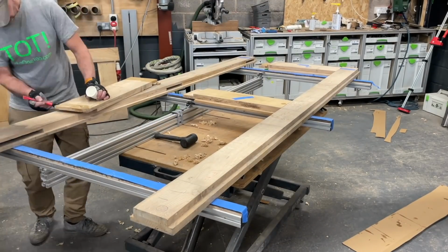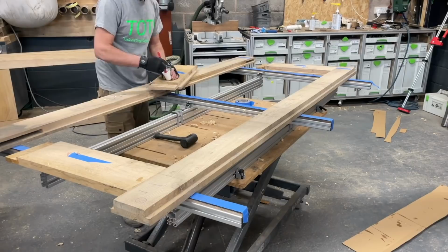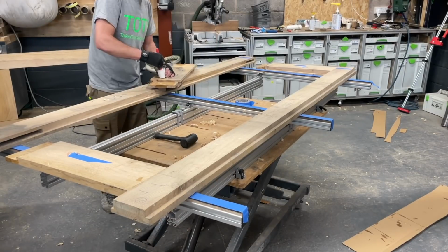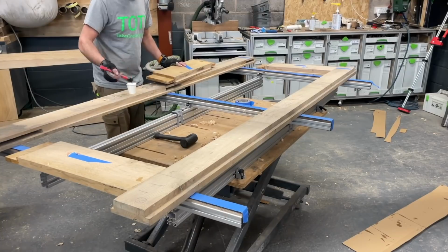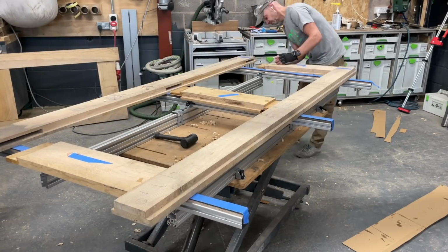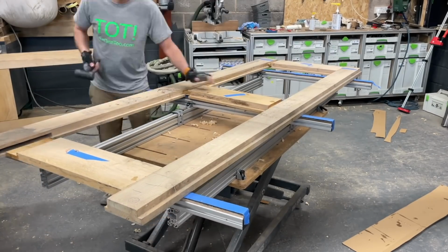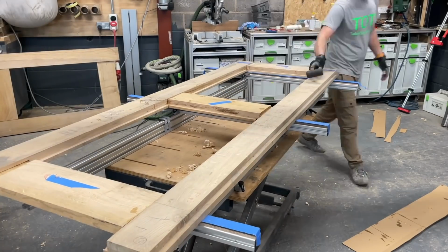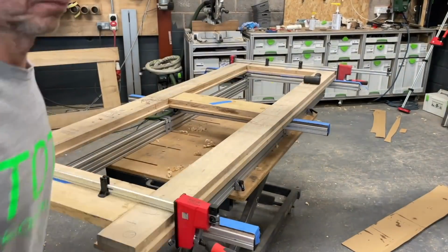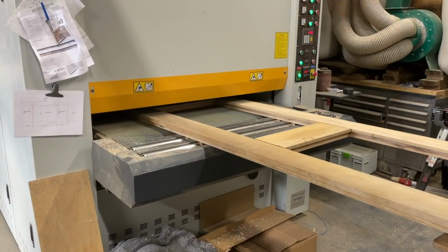But you do need to take into account the setup time and the cost of machinery for this kind of joint. The other major advantage is the test fit. So the dry fit of these kind of joints, you can bang them in and out, pretty simple. Putting this many Dominoes in, maybe two or three per joint, and trying to remove them before the glue up for the test fit can be a real pain. Now I decided to use the big machines I had and use a more traditional mortise and tenon because I had so many doors and joints to make. I thought it would be a quicker, simpler system. I don't necessarily find it a stronger solution with resin.